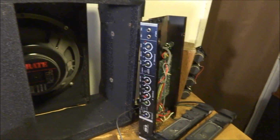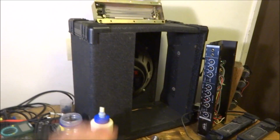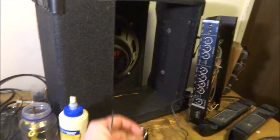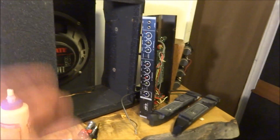No matter what you do, you'll get some sound, but the more ohms you have, the less maximum volume you have. And this only applies to solid states, not tube amps. So many amps you can't use quiet. If you don't want to turn up your amp really loud, and it's hard to adjust the volume, you can just put a bunch of speakers together in series.